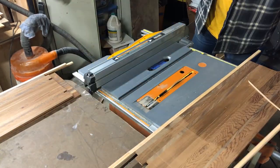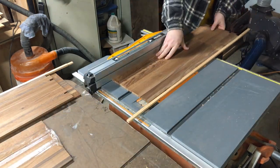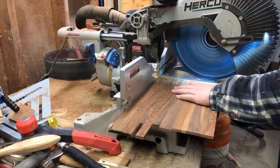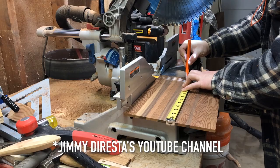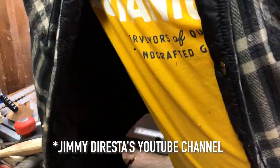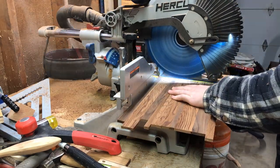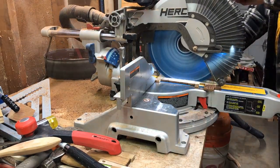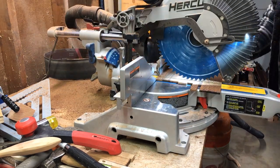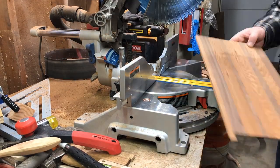The beautiful thing is the runners I cut off ended up working out really well to go underneath the clipboards while I was adding shellac. Now this is a little tip I learned from Jimmy DiResta, which is just genius — it's so simple. I cut the first one to the correct length I wanted and then I just marked on my miter saw with a sharpie, and I could just line up each one to that mark and cut it. Didn't have to use a stop block, nothing. So thanks Jimmy.